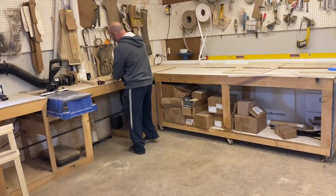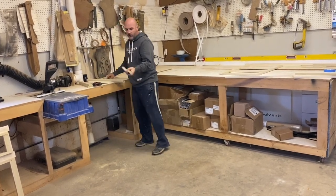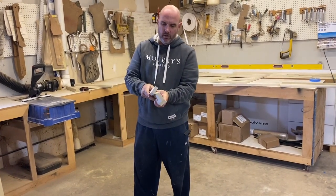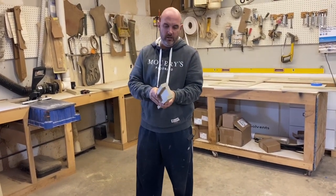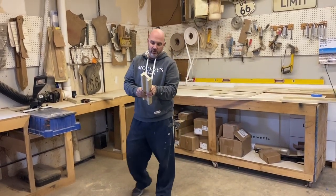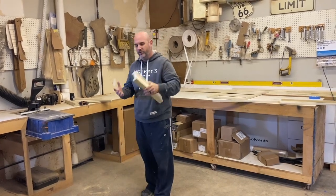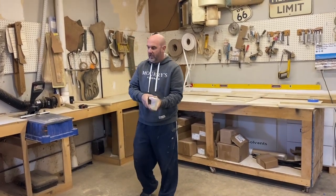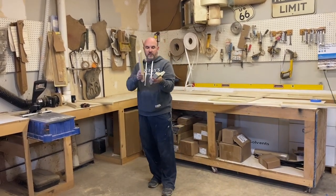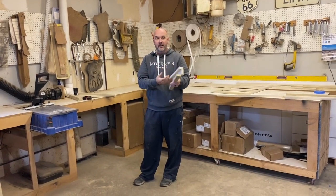But what ends up happening is I have to take one piece of two-inch face frame, a couple one and a halves, and then I just go to that Foreman jig and I do this. I could shoot this together with nails, but I actually loaned out my battery nailer to one of my trim carpenters. And this is honestly stronger anyway. I'd rather it be beefy. And then the top one is just an L, like so. And then the granite just comes out and it gives me a perfect place to hide an LED strip too.